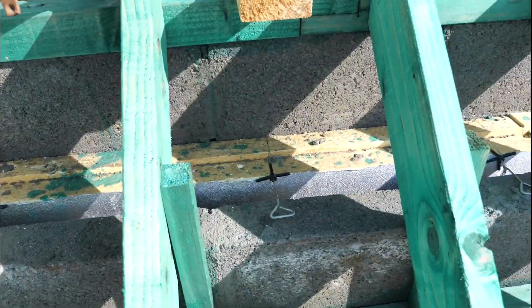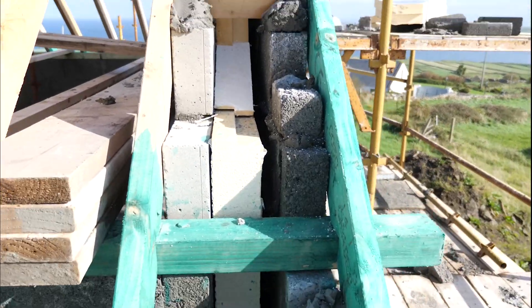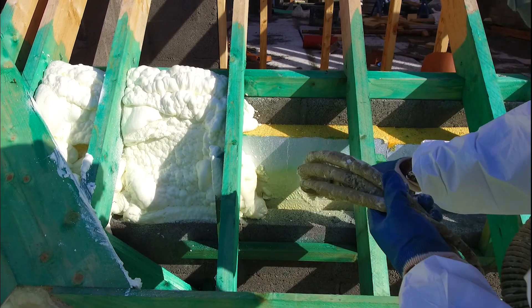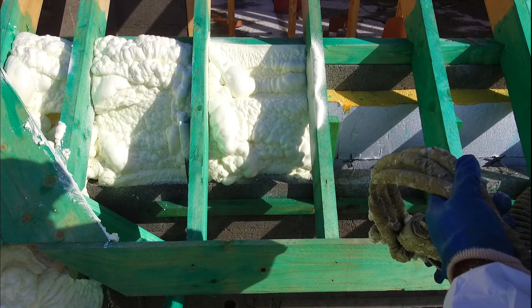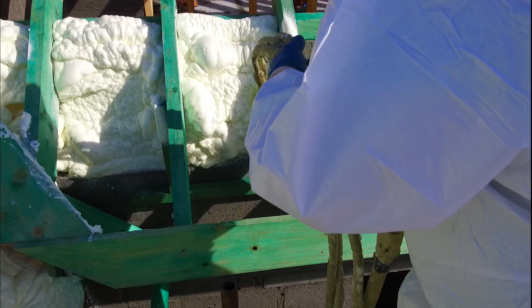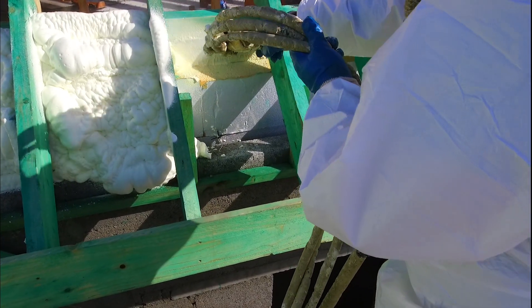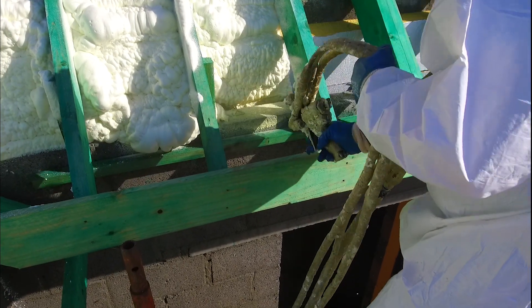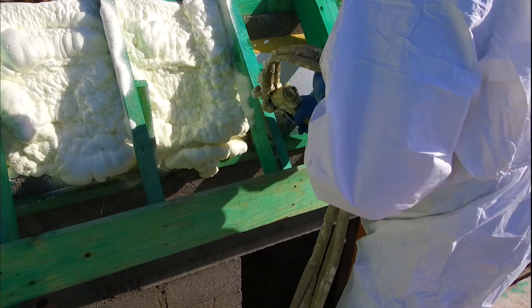This customer was very fastidious, very nitpicky about thermal bridging, wanting good air tightness and good thermal isolation. He asked us in at this stage to spray the area you see now in frame. There are a few benefits to doing this. We sealed the cavity by spraying open cell foam in this case — we could have used closed cell, but the customer preferred open cell; he was familiar with the properties of both.